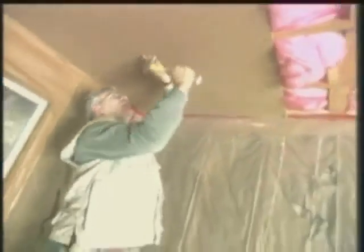Over the years, my experience in soundproofing ceilings has always been to, first of all, apply an insulation batt material between the joists. That way it gives a good joist fill, not allowing any of that sound to be transmitted up through. I'm applying now 1/2-inch Donnacona board, which is a wood fiber board, quite often called tentest as well. And it's used for many applications, for exterior sheeting on a home. In this case, I'm using it for a soundboard to help stop that transmission of sound, again, upwards.